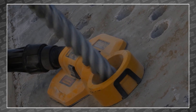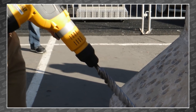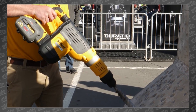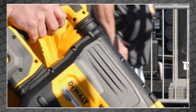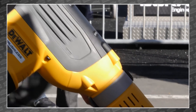The 2 inch hammer provides a staggering 19.4 joules of impact energy and tackles horizontal and downward drilling for number nine through number 14 rebar dowel applications, dry coring up to six inches, chipping in lower walls or floors, ground rod driving and bushing. Both drills feature the Dewalt Perform and Protect anti-rotation E-Clutch system to protect you from bind-ups and the SHOCKS active vibration control system to reduce vibration.